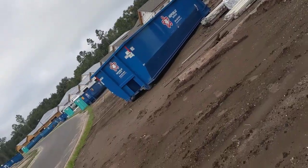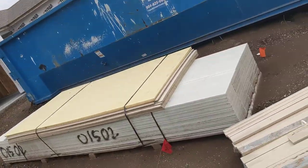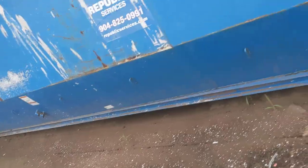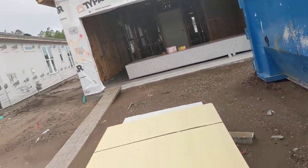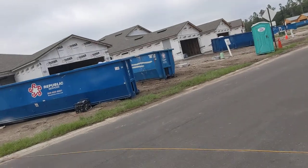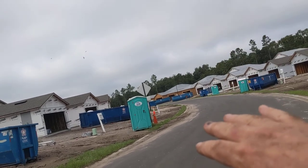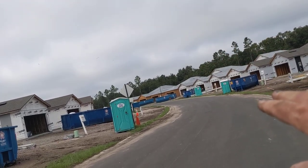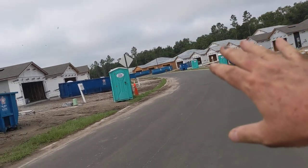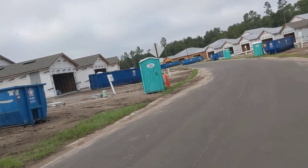This permit box — we're taking good care of these. The architectural drawings, we really don't need them anymore. The structure is done; as far as vertical strength from here, the rest is just finishing. So I can take these — they have done their job, getting us through insulation, tie-downs, mechanicals, and all that. The last one on the right-hand side, 29/30 — I want to get that tie-down inspection passed today. We passed 27/28 tie-downs yesterday, and Eric was given the okay to house-wrap it. We'll see how the day progresses.